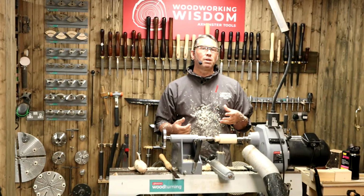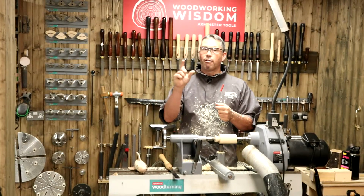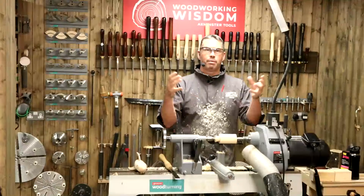It's not like a thick oil. It doesn't attract the dust half as much. The other thing with camellia oil is that you can use Garryflex blocks with it. They work well together. And if you get any moisture on the bed of the lathe, so any rust that might form, and that can be overnight, for instance, using them in combination will take it out.